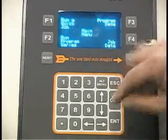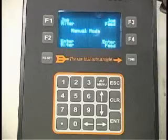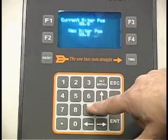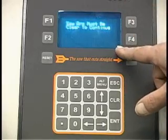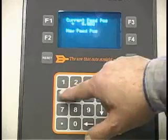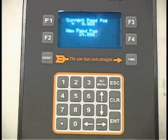There are other things the computer will do — we'll look at the alt menu. Alt menu allows you to get into manual mode, system setup, or more. In manual mode you can do four things: jog the miter to move the arm to a certain angle, enter a specific miter angle — for example, tell it to go to 90 degrees and punch in 90, press enter and it'll go to 90, though it'll say stalled because there's no hydraulic pressure on this unfinished machine. You can also enter a feed position, such as 24 inches, though that won't work either since there's no feed connected to that cylinder yet.